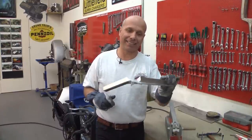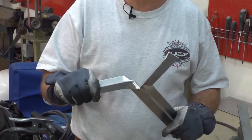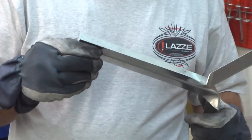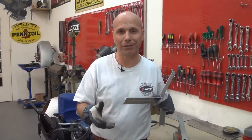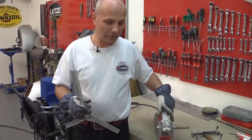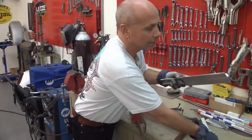So what is this? These are two pieces of aluminum angles put together — and it looks like somebody destroyed it. That's exactly what we tried to do. It was one of my students in Sweden — an old Italian guy taught him how to spot weld aluminum. Normally it's very difficult to spot weld aluminum, and you may need a water-cooled machine costing twenty or thirty thousand dollars, because newer cars use more and more aluminum. That's very expensive, especially if you only need it a few times. But this old guy from Italy taught my student in Sweden to do it with a regular 220-volt spot welder — 110 volt will not make it.